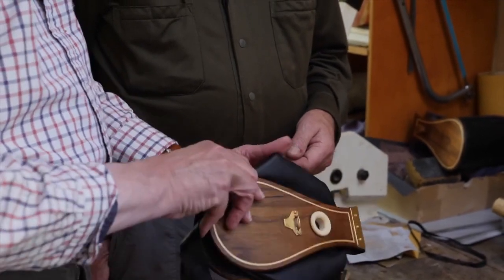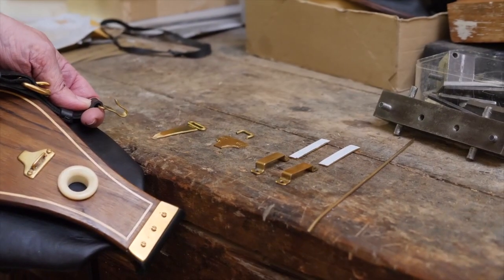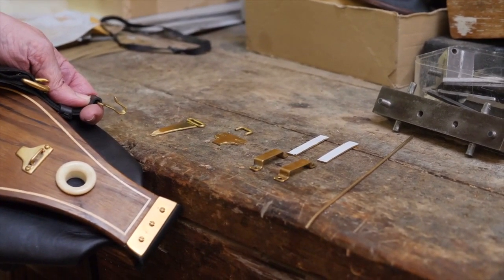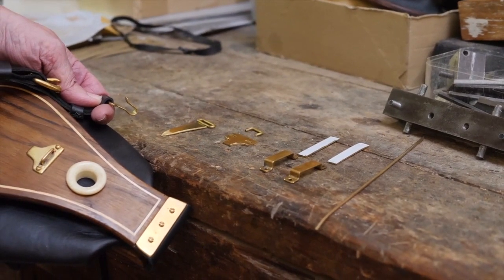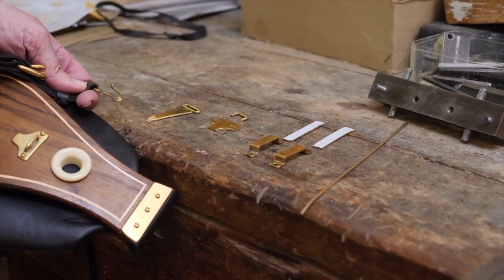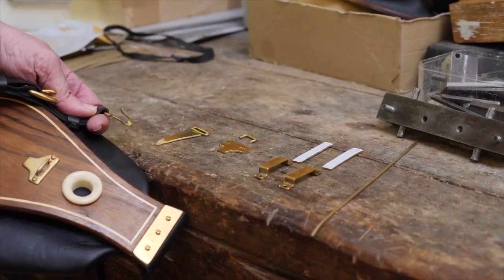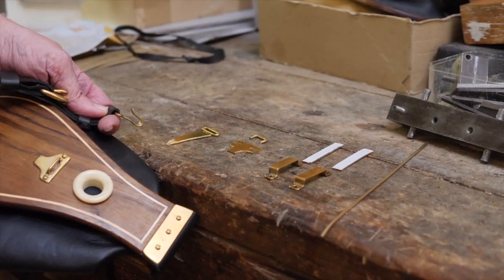So if we look at the parts for each of those, looking closely at each of the fittings, all of the flat parts are made from your same 16 gauge brass sheet. The round wire parts, what size do you use for that? 3/32 diameter brass rod. Okay. And you anneal everything before you start working it, by heating it up, you were explaining earlier.